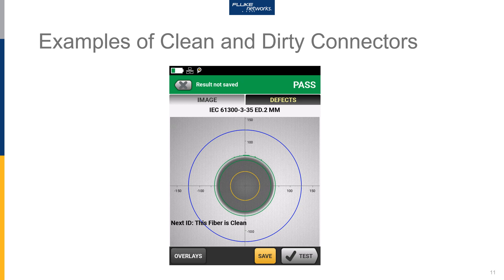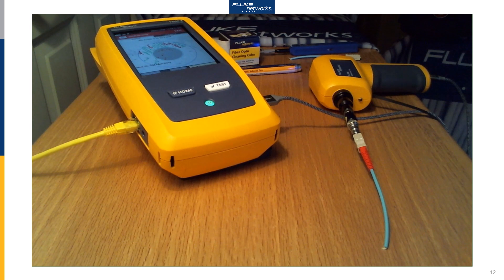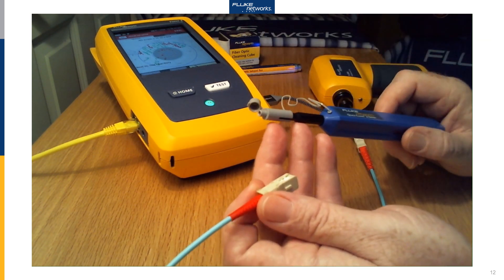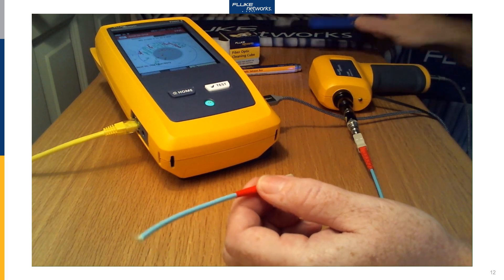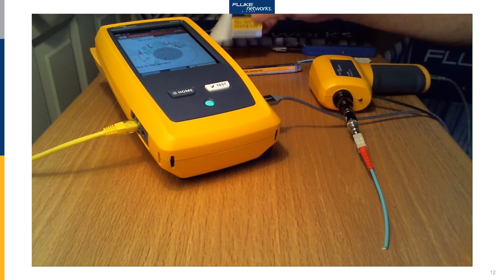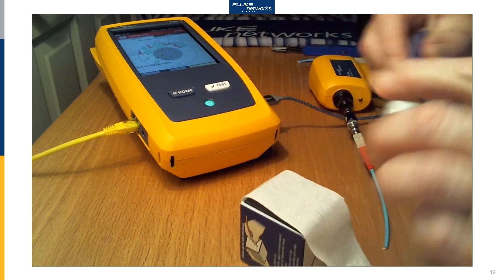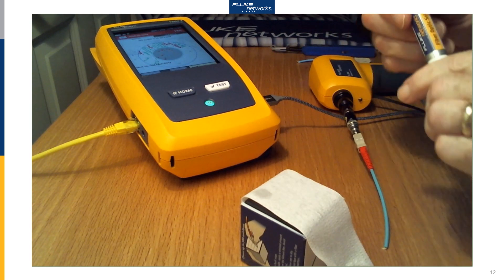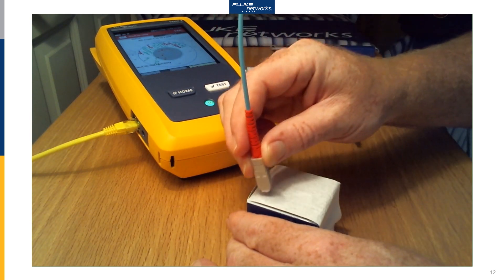We've seen how to do the inspection, and here's that clean fiber we just saw. They're not always clean — this one has a fingerprint on it. The expert module will show us where the defects exceed the requirements of the standard. So we know that this fiber is dirty; let's take a look at two different cleaning techniques. For the first one, I'm going to use that click cleaner. I like to use a couple of fingers to line it up so I don't mash the end face — just give that one click, that's all that it needs. Let's spend a minute on our hybrid cleaning where we're going to use both the solvent pen and the lint-free wipes. I'm going to put a drop of solvent on the corner of the wipe, and then take the fiber and run it from wet to dry, from wet to dry, from wet to dry.